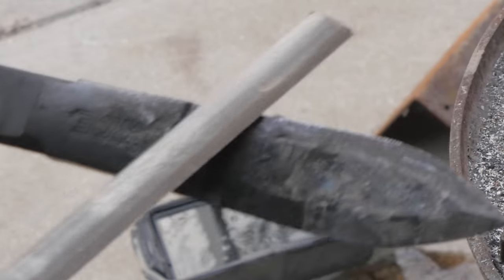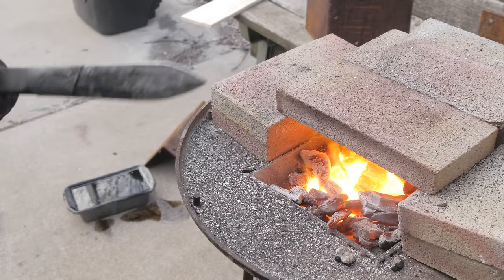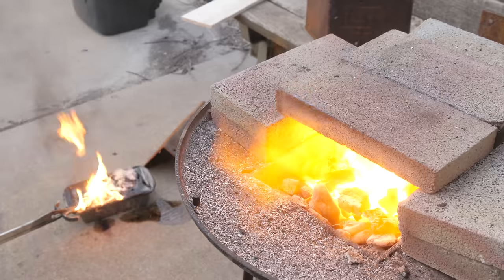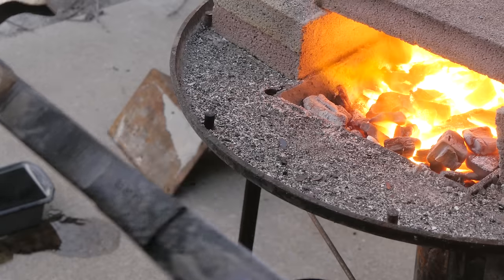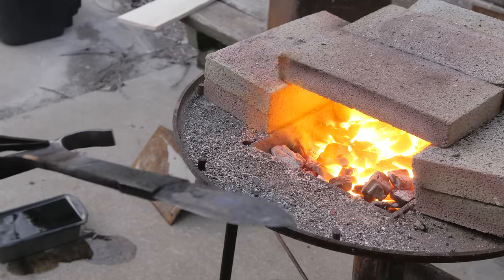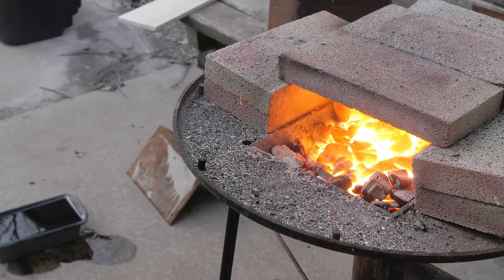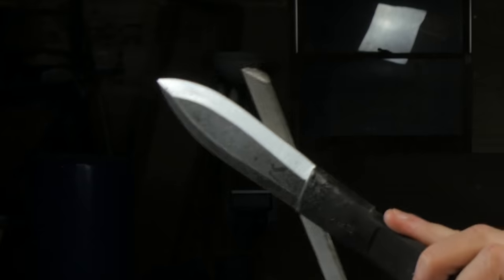Here's the first one — oh lord, let it be. I don't think it took — yeah, that's definitely biting into it. That sucks. Give it another go. It's noticeably more yellow than last time. Round two. It's better but it's still not skating. Could it be that this steel just doesn't harden as hard as this file? I mean, these are pretty cheap wrenches. I got that quench about as good as you're going to get it. I don't know what kind of steel this is. I'll let them cool down fully and then give them a test again. Nope. If any of you guys are slightly disappointed with the way this video is ending, allow me to direct your attention towards the way I freaking feel right now.